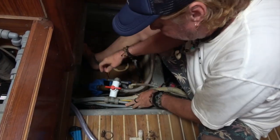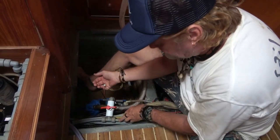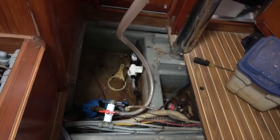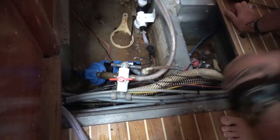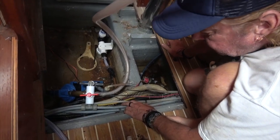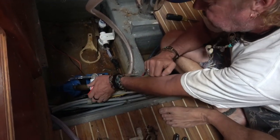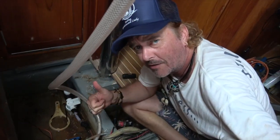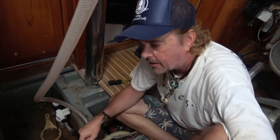It's hooked up — both lines are in and tight. I've closed the valve since I don't have anything hooked up to the outlets yet, so this just stops pressure from escaping. Now we're going to pressure test: we'll turn on the pump and keep all fingers crossed that we don't see any leaks. Pump coming on... so far so good. Let's open it up and see what happens. We're in business — no leaks! Now we can get back to plumbing in the lines, getting all these tubes hooked up and run over to the water maker, then pull out the pump and water maker to prepare them for the lines and power wires.